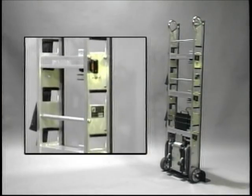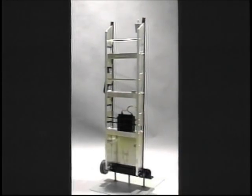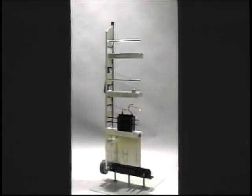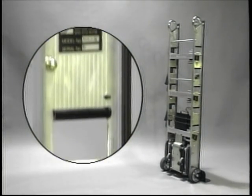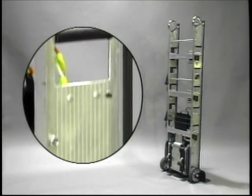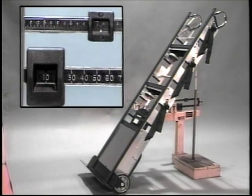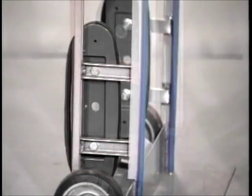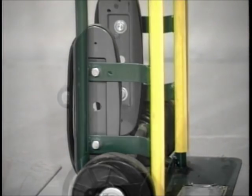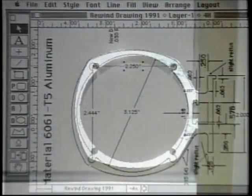The Escalera uses a lightweight aluminum modular construction; however, all the moving parts are steel. All parts on the Escalera are easily replaceable by the operator in the field, and we ship all parts orders the same day the order is received. The Escalera has numerous handholds down each side frame as well as handles across the center of the unit. It has an extremely low center of gravity, so it's very light in your hands — only 17 pounds tilted back. The Escalera is extremely narrow, like traditional non-powered dollies, for getting into tight quarters. We use computer-aided design to design the parts for the Escalera, and we believe that form follows function.